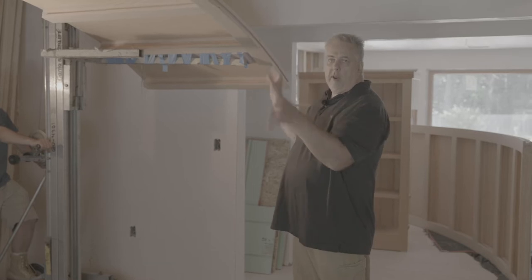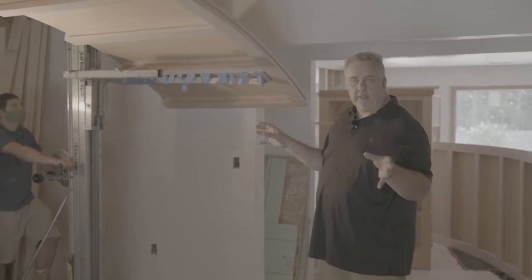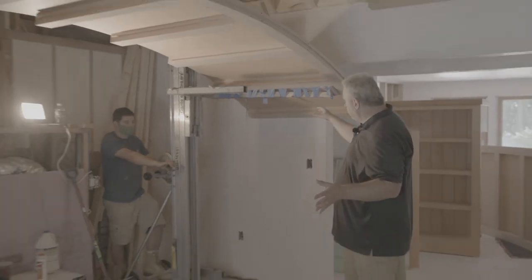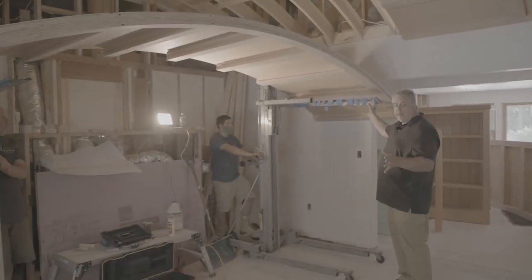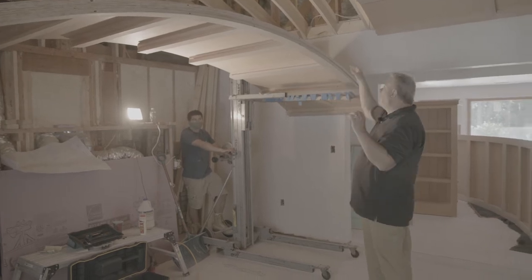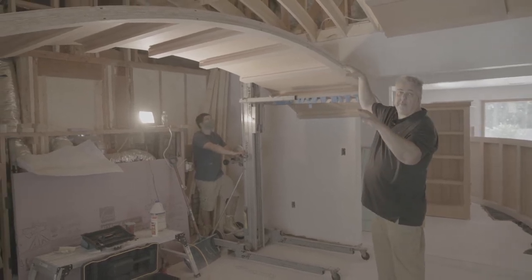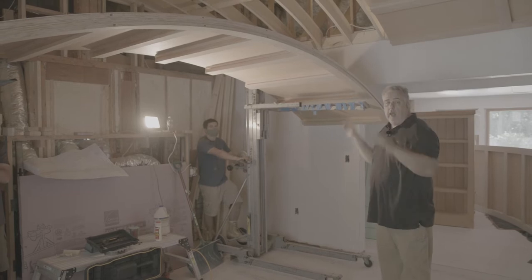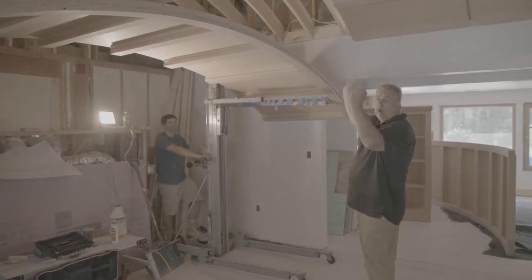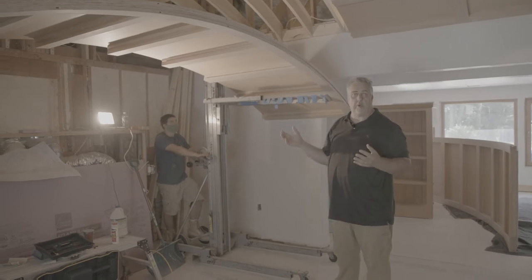You can see we got one of the panels in place. The means by which we install these panels — we have a couple of lifts here. You can see we have good protection; it's all fully padded. We basically just crank this up. We have some metal straps up on the top side that'll get screwed in at the attic level to hold this in place, and we have some stuff going around the perimeter that will also help hold it in place.